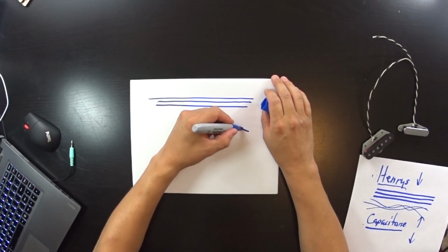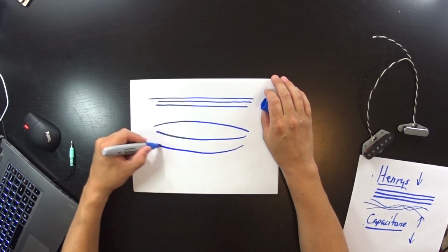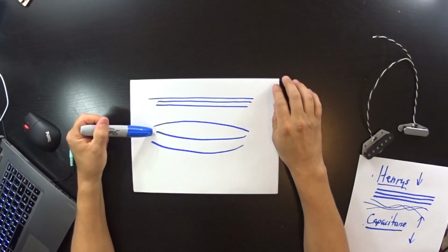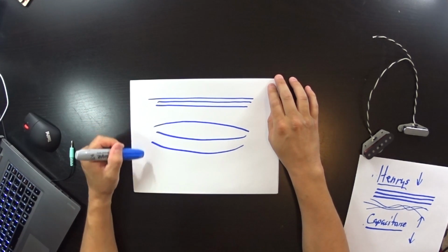And here's what happens. If we go back to our 3 windings, so now we have 3 windings that are pushed apart. So what happens? The capacitance falls, and the efficiency of the pickup, the inductance, also falls. How do I know this? Because this is an experiment as a result of things I've seen on the internet over the last couple days that I tried to do.